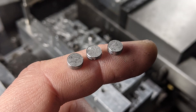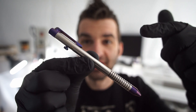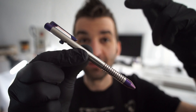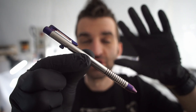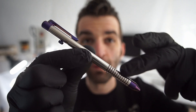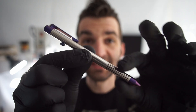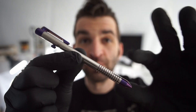Here we have the little slugs - I actually was able to get about six, so that's perfect. This pen is something different: it's a full titanium bolt action pen and it's the first production unit I've made. Design-wise it's exactly similar to every other bolt action I sell; this one is sized for the Parker style refill. The only difference is there's so much extra handwork done to this one. The whole body is titanium. I went ahead and anodized this one purple and then wet sanded it after the fact to bring it up to a full polished finish.